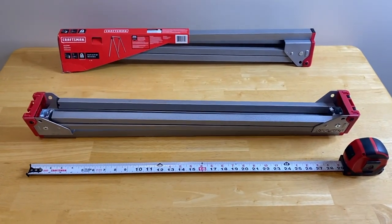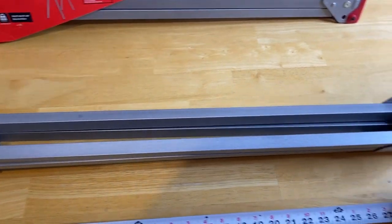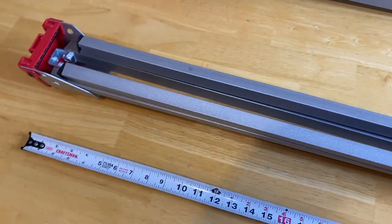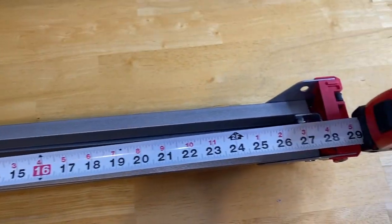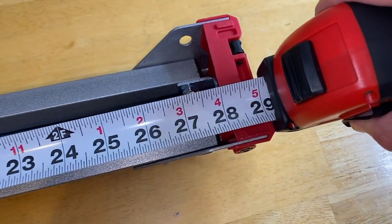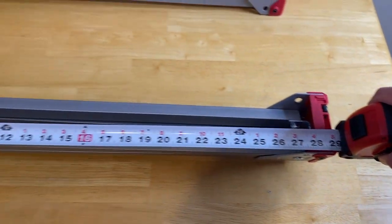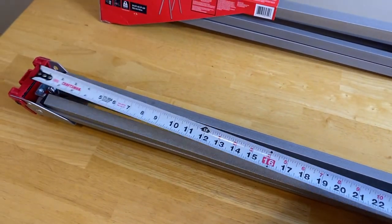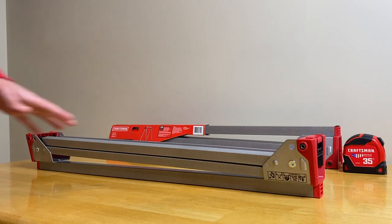Next, I flip the Sawhorse upside down. I do want to give you the measurement of the legs and all of the legs. Again, 4 of them will be the exact same size and measurement. And they are just over 27 inches, almost 27.75 inches. Again, that is each of the Sawhorse legs. And a quick reposition of the camera.